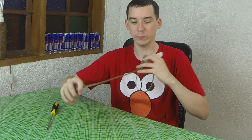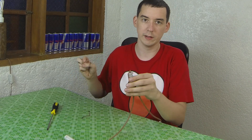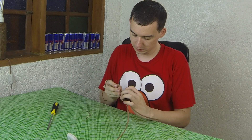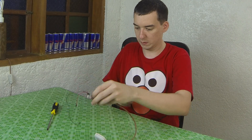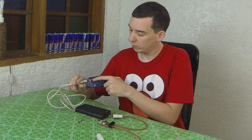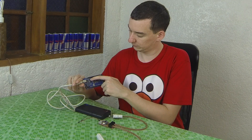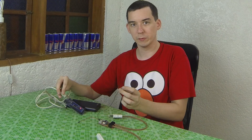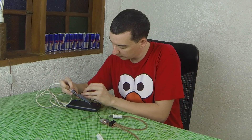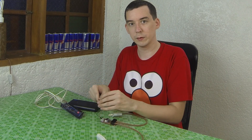Now we need to connect the Arduino. The Arduino plugs into these contacts here and they're marked positive and negative. I've uploaded a sketch to my Arduino which turns pin 13 on and off every 5 seconds, and I'm just running this from a USB battery pack. I'm going to connect my ground from the relay to the ground of my Arduino, and I'll connect the positive of the relay to pin 13 of the Arduino.